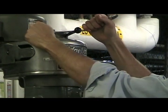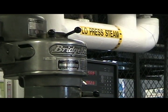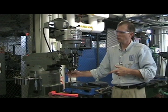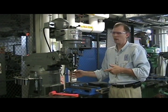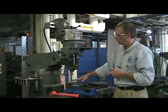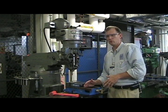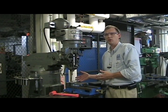Put your wrench back up. Your end mill is now securely fastened inside your spindle. Your part is as accurate as can be made in your vise jaw. Now you're ready to start machining.